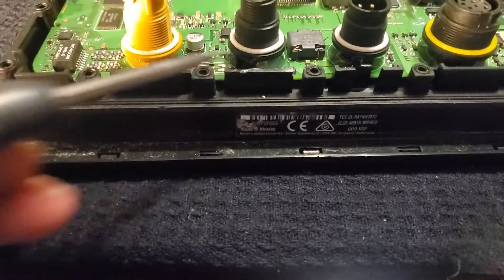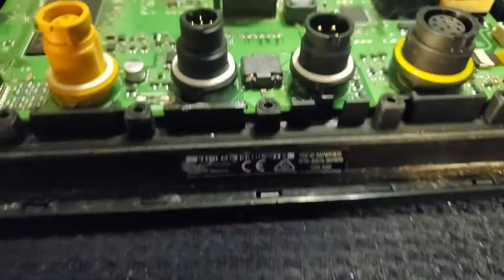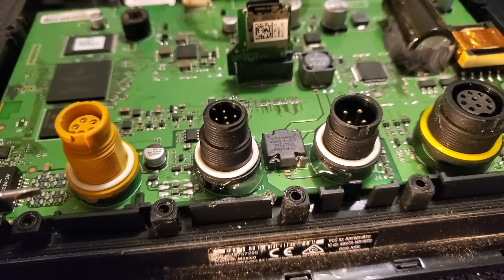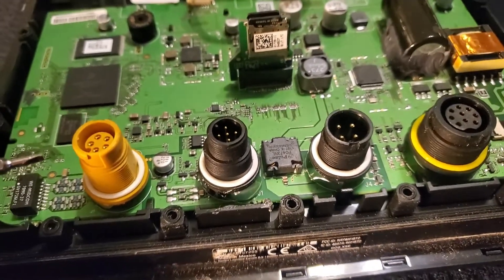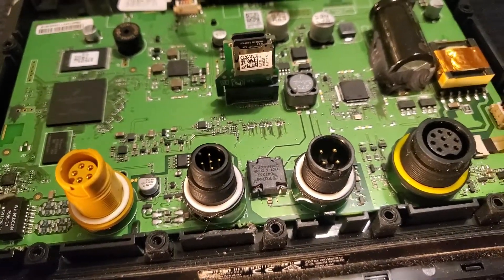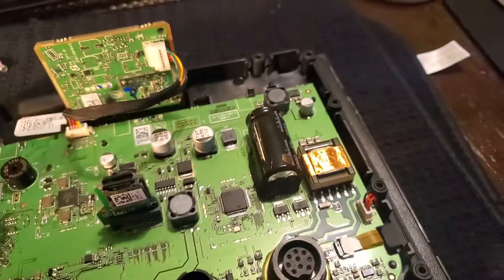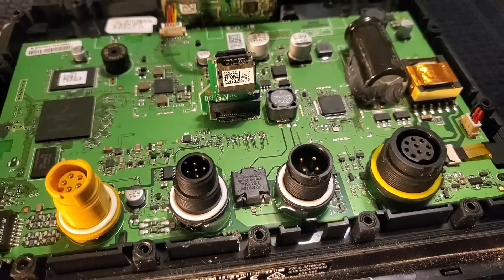As you can see, I added some hot glue around these columns, connecting them to the printed circuit board a little tighter, because there's no real mechanical connection to the board other than the pins soldered to the back of the PCB. It can't withstand the kinetic force of a good twist when you're connecting cables — especially under harsh conditions where things get a little stiff. Simrad's got to beef this up. I'm also going to add a little dielectric grease to all these connectors so I don't have that twisting problem anymore — but I got real lucky, and I'm hoping this works out well.